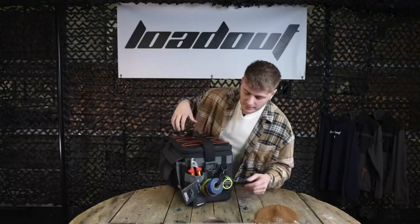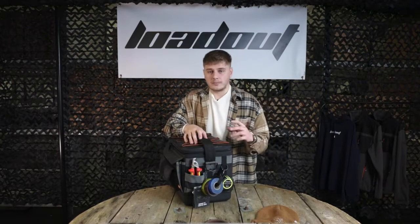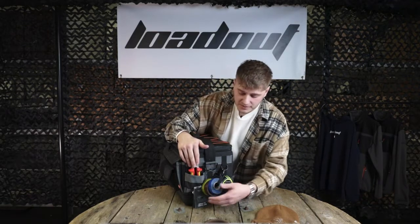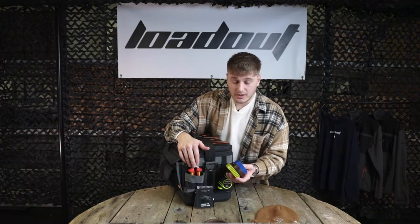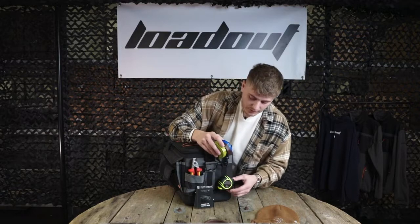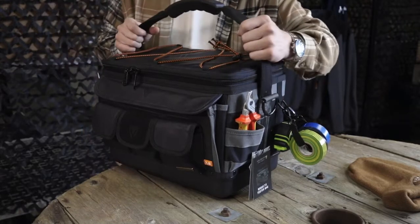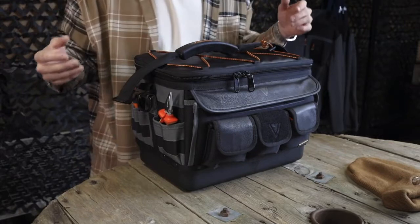Then this side, I've got a pair of croppers. So you're going to be taking stuff apart to inspect it. You might have to re-strip a cable, remake something off that's a bit dodgy. So you certainly want a pair of cutters in your testing loadout. I've got some tapes as well, usual colours there, but you might have the 3-phase colours or something like that too if you're doing more commercial industrial stuff, and then a tape measure there too. You're going to be looking at replacing bits of kit. You might be surveying a job after inspecting it, so a tape measure is going to come in handy for measuring up stuff like that.